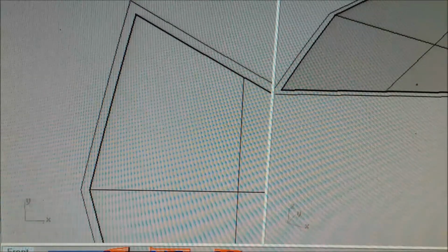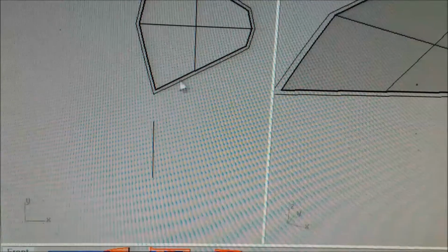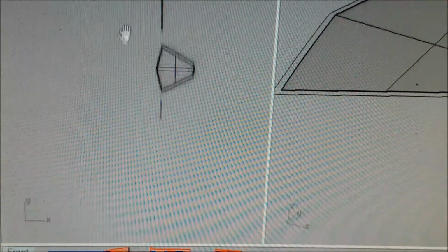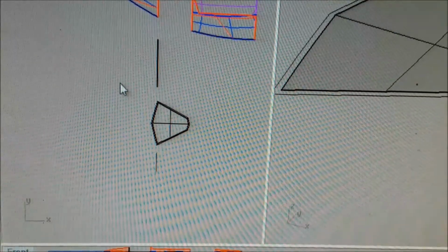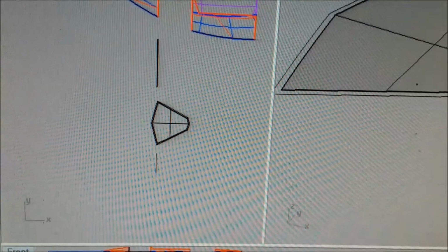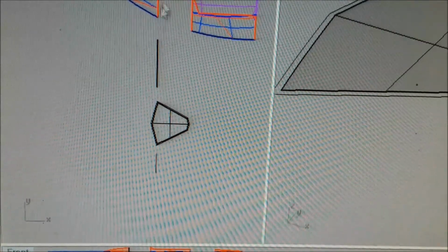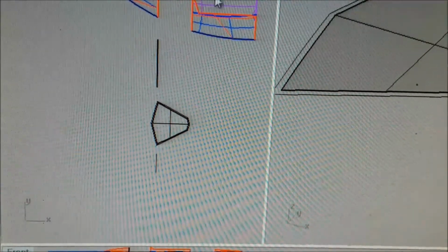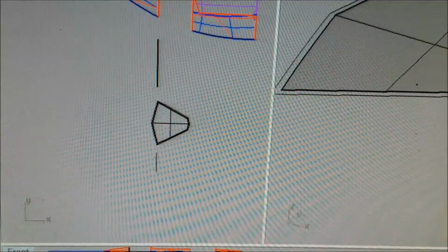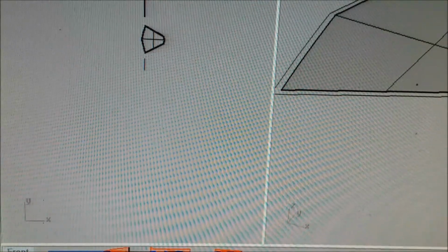So now this bulkhead will define the inside of the boat. And basically as you put it together, you can press this in and you can measure how far back it goes. You can draw a line on it. That's what we do with the aircraft molds, like fuselage molds. We just draw lines measured off of a common datum point down each curve, and then that tells you where you want to shove that to, and that'll reinforce the shape and make you a rope locker. And then you have this area here that you can sit in and throw stuff up under there. I don't know what this is, like a dory. And then you can do the same thing, make a bulkhead there.